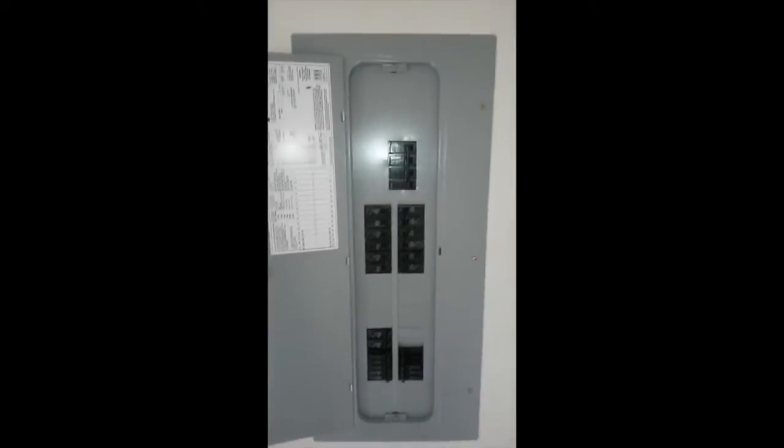Now all we have is the electricity, which goes over to this box here. You always want to make sure the power's off before you hook up any wires. Make sure your power is off. I've already flipped the main breaker on the house, so I know it's off. Because you can create a havoc by touching these together. Okay, there we are, bared. Get rid of this floppy part here. Okay, you put your nut on the back.